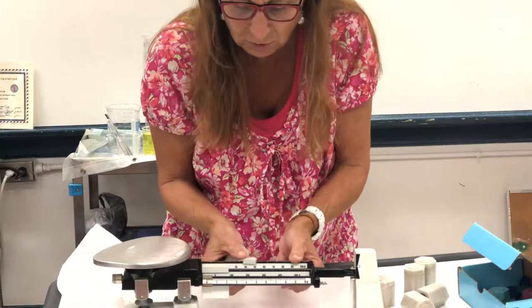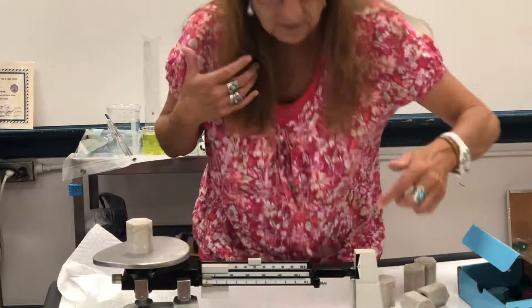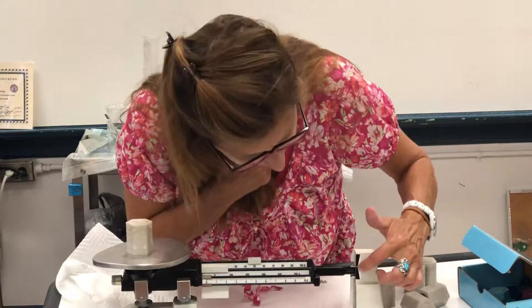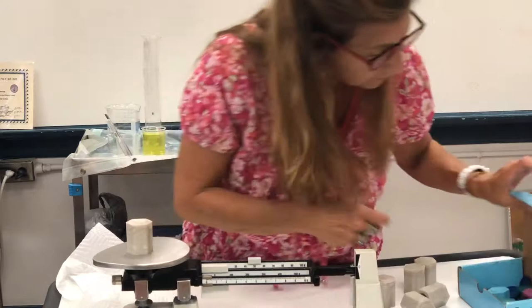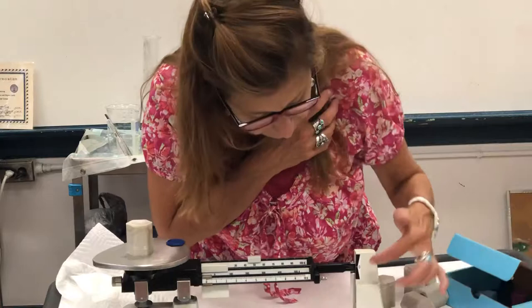You can feel it and you can hear it. So when I set that mass on the 50 and I put my 50 on there, my balance now is going to move up and it's going to zero itself here on the zero on the side of the balance. I'm going to add a couple masses here because it looks like my balance is a little bit off — it's off by one total gram, that's still pretty accurate. And you'll see that this now points at the zero, which means that I've reached the balance point.